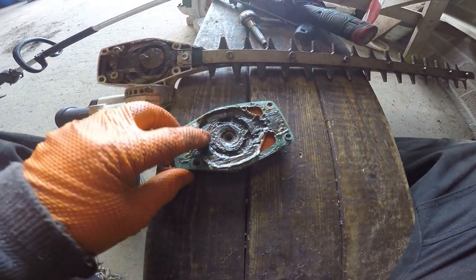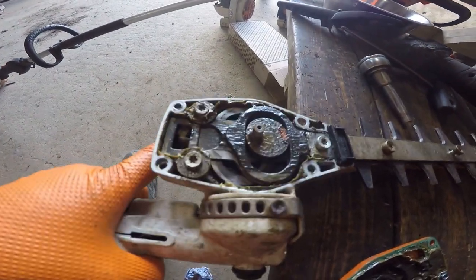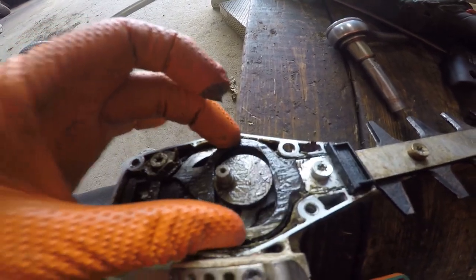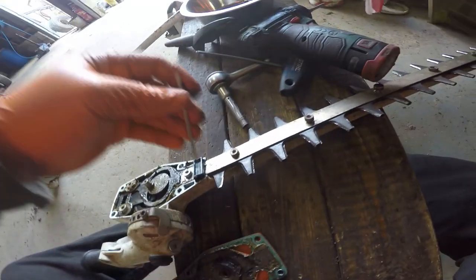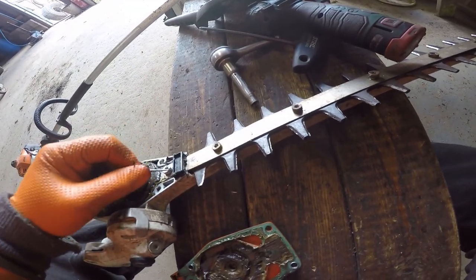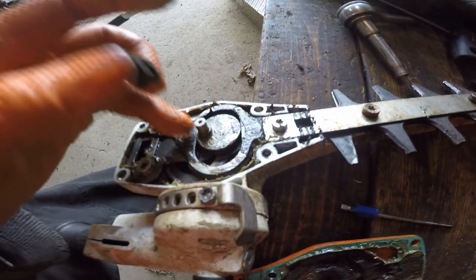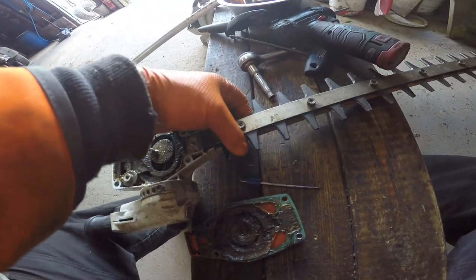That's the grease in there, and you can see it's rather stiff. Knackered. There's not very much grease actually on the bearing surfaces inside, and it looks like there's water dripping in. See this rusty bit? Probably is rust. Right, this has to come off here. This is basically a seal, helps keep the gearbox full of grease. And then all these screws come out.